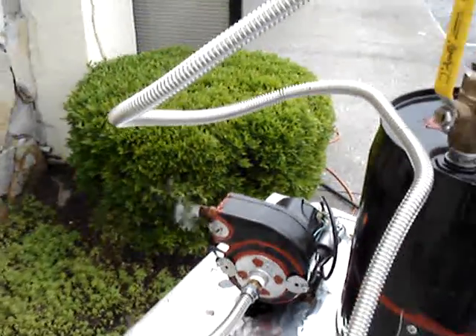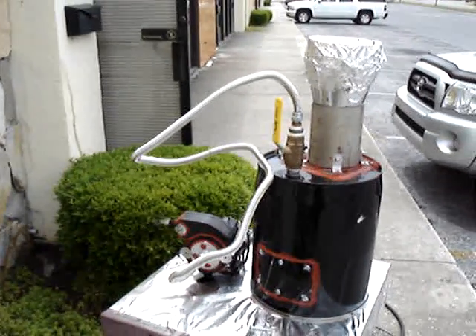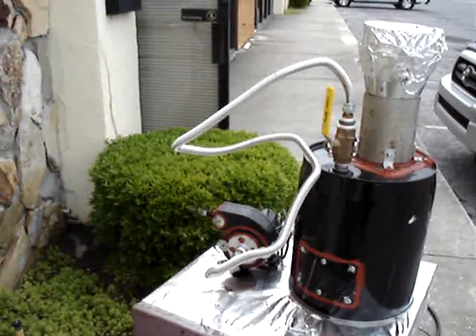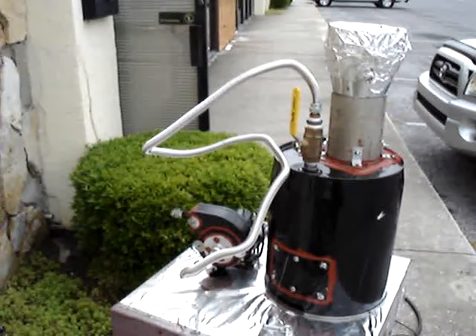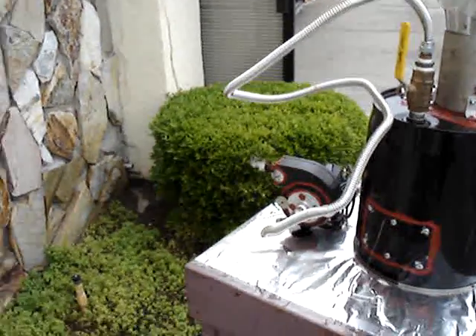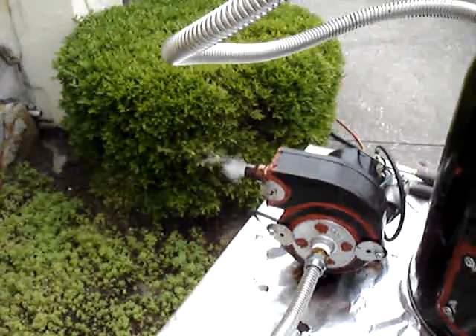Here's the setup so far. One problem I'm having is that the hose is too narrow — it's constricting the flow. I'm not getting a good flow through the gasifier. But if it was attached to an engine, I think there'd be a stronger draw than my little pump down there can do. But it's working remarkably well as is, so it's producing flammable gas.